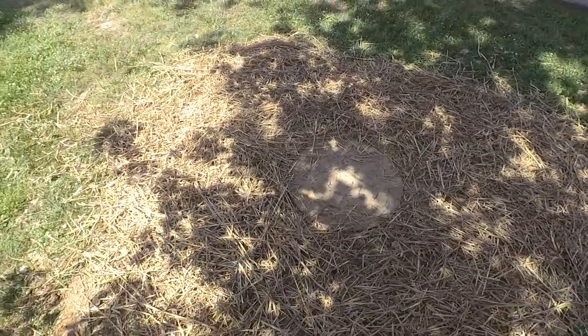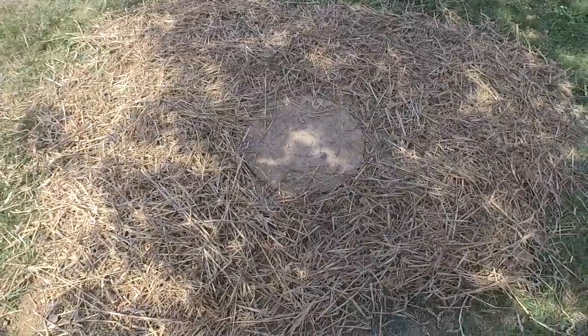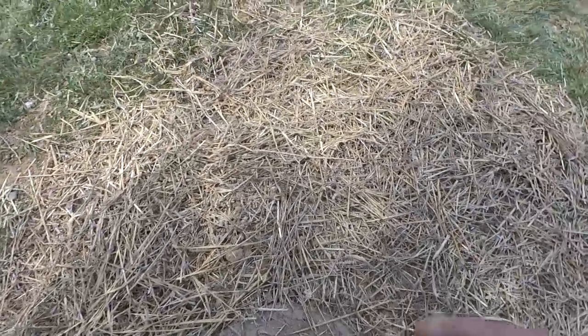We're finished over here with this manhole cover. So those 2 6-inch risers worked really well to bring this up to grade. And so this thing is just as solid as can be. We packed it really well around it and seeded and strawed it, so it should be good to go.